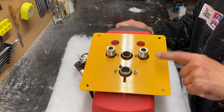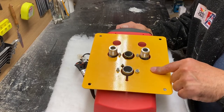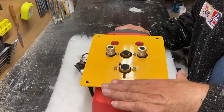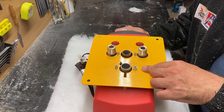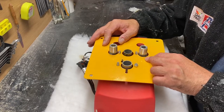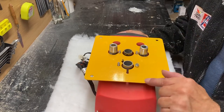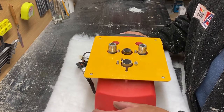Now the problem we've got, this is the next problem, is that the holes that have been drilled out to fit this machine don't fit. It's not quite accurate, shall we say. So I've got to re-drill some of these holes a little bit bigger so this plate can sit down further onto the seal. Unless it's not meant to, if somebody can tell me that, but I'm just guessing that, with it being a bit of a Chinese product, the engineering precision's not that great. I'm assuming this is not meant to be like this. So I'm going to get this drilled out a little bit more so it can sit down. Then I can sit this on top of the station, bolt all the other bits to it, set the system up, put the electric to it, and we can test this out.